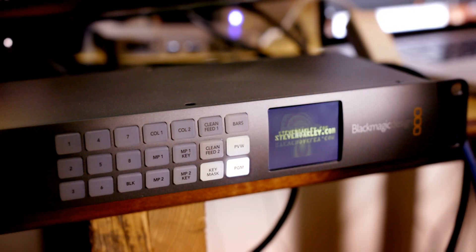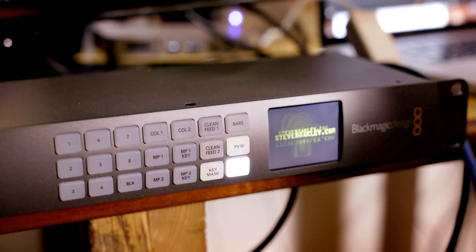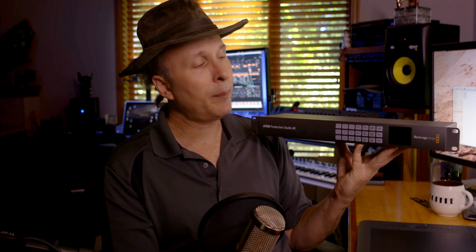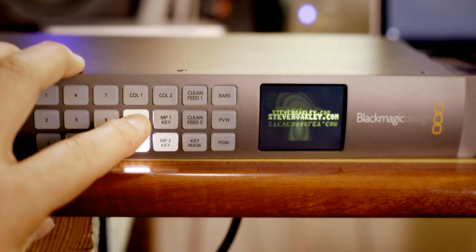Let's talk about the buttons on the front of the unit. If you hit any of them, you can look at program, all your sources, and your media players up on screen — you'll see whatever's coming in or going out depending on which one you picked. This also selects what video is being fed out the auxiliary output. It's pretty cool that this unit has an auxiliary output because it lets you do a couple of things: one, you can do a nicer record; two, if you wanted to do something really down and dirty, you could use the auxiliary output as your program and do direct cuts between cameras using the front buttons. You can only do cuts that way and the unit wasn't really intended to be used as a switcher this way, but for certain situations it may get the job done. It's a nice option to have available.